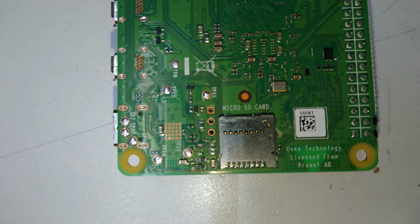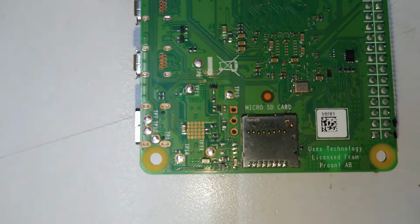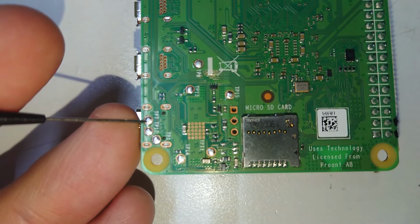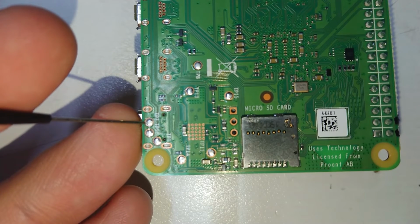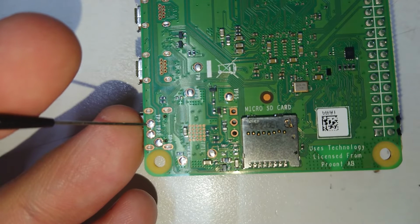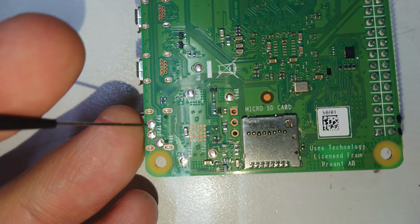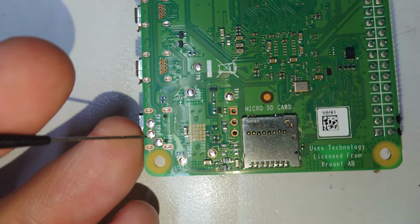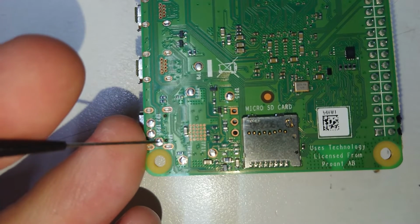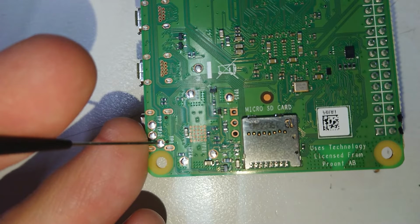We will be back. I've had a little bit of an epiphany here. I'm going to try this the other way around. Pretty sure these are both ground. And I had the polarity wrong. Yeah. So, 39 here, pin 39 should be ground. I'm not getting anything. I am getting something on the I/O port. Try here, they're both connected. This 3rd pin here I think is the polarity, or is the positive one.